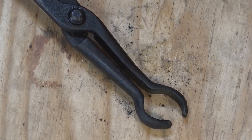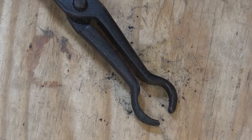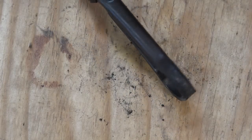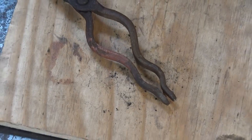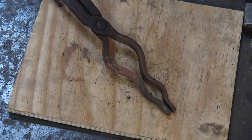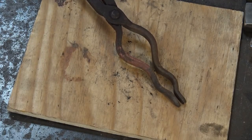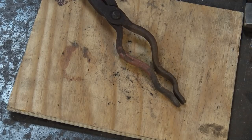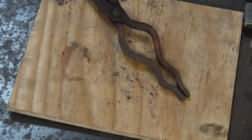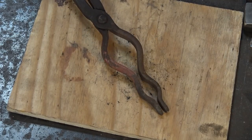This is a style of pickup tongs frequently called power hammer tongs, and they're very good for manipulating stock under a power hammer. This one looks like it's had a stray whack because the jaw is kind of bent, so I need to fix that. And then there's a more conventional pair of pickup tongs — just a lightweight pair meant for picking stuff up out of the fire, or if you're working in a gas forge you need to fish something out. These have longer handles. They're not meant for forging, just for grabbing stuff, picking things up off the floor, fishing around in the slack tub.